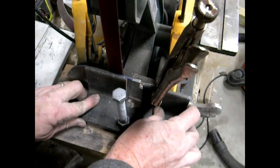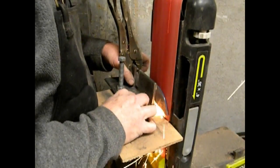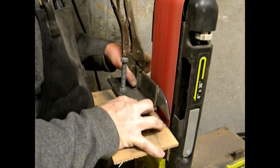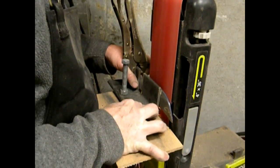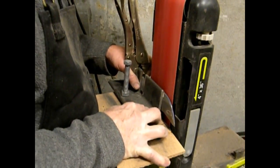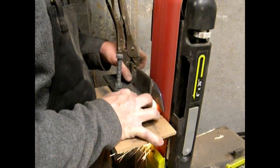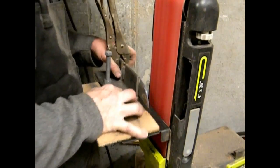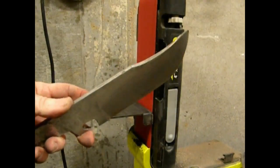I eventually gave up and went over to a four inch belt sander. I had modified the four inch belt sander previously — I just cut away some of those side rails so that you could work on bevels. This sander was able to remove material a lot faster; it's just a more powerful machine. It doesn't take all that long now to get those bevels even on both sides.